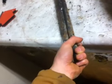I also got an automatic darkening helmet — very much better than the manual ones, because you should be using two hands to weld, especially if you're a beginner. When I weld, I put on these gloves and actually hold right before the tip here. You can hold that and actually perfect your circles and get them more steady, and that should help you out, especially with doing beads.